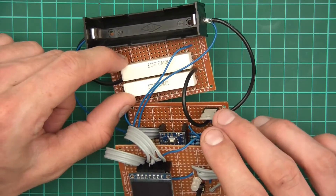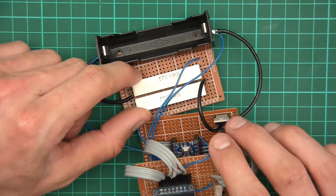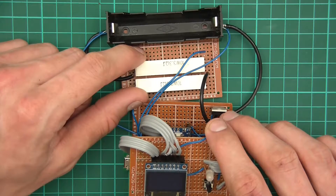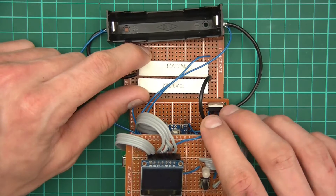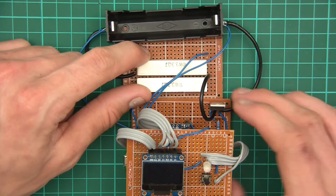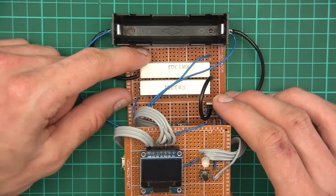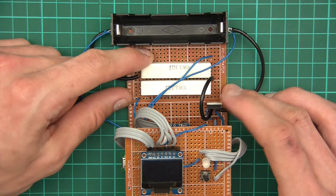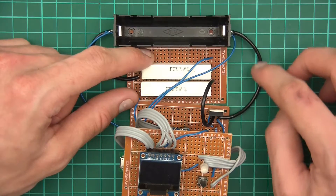From here I've got a black wire going to the MOSFET down here. As you've noticed, there's no heatsink and there's only one MOSFET — I've dealt with that overheating problem. It was two things: poor wiring design, and the voltage the gate pin was getting relative to ground wasn't quite right. Now it gets more voltage, it closes more effectively and doesn't generate as much heat.